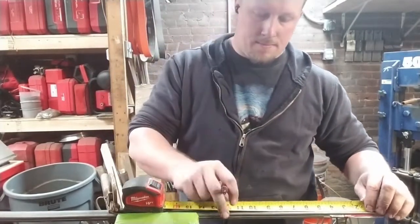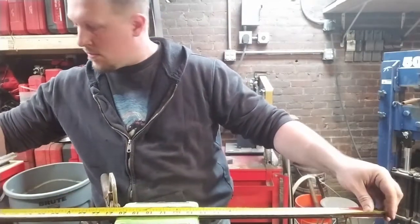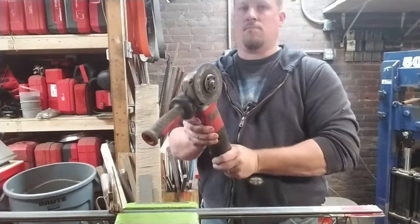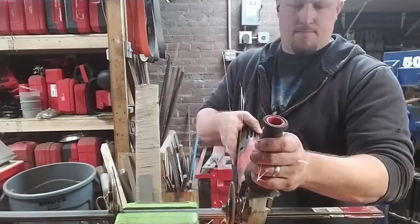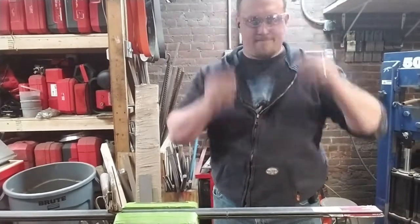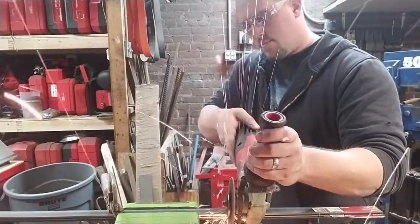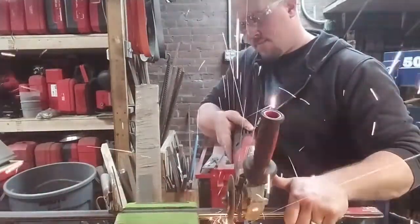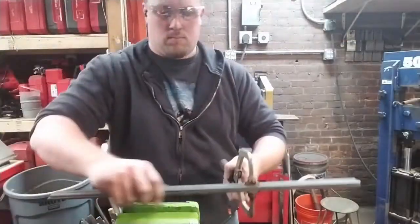So at a rate of 5/1000ths of an inch per hour on 2-inch thick bars that were used in Sheffield, for instance, those furnaces had to run for a week. But here, with 1/8 inch stock, you can, because you're going to have the carbon moving through the steel from both sides. So 1/8 of an inch is 0.125. It's moving at a rate of 0.005 per hour. You can get halfway through in 12 hours. So that's what we're going to do.